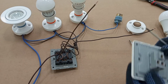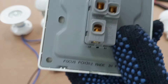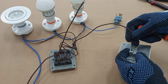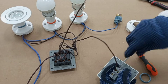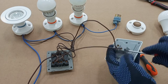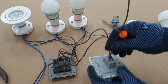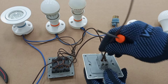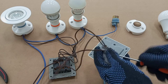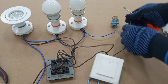Here I have L, then L1 and L2. My strappers will come to L1 and L2 so that I can use this switch and the other gang on the four gang switch to control that particular light. The second strapper will come to L2. I will then need a different switch wire that goes from the terminal marked L here to the lamp holder.